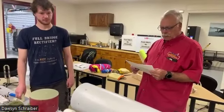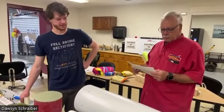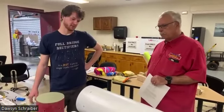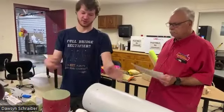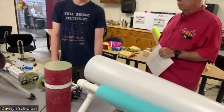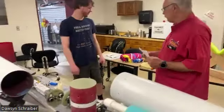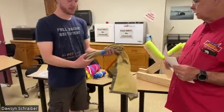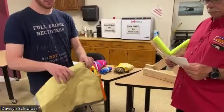So the nose cone, well, it contains a payload. We'll talk about that more later, I guess. Yep. But how is this recovered? Or is this ejected? Nope, it stays right there. It doesn't move. But is the nose cone coupler ejected? Yeah, so the nose cone and the coupler are ejected from the rocket to allow the main parachute to come out. But these two stay together. Okay. And the shock cord length, so this is main out here? Yes, so that main is 30 feet, right here. The main shock cord looks like. And then, yeah, main is attached on here, 30 feet. Okay,